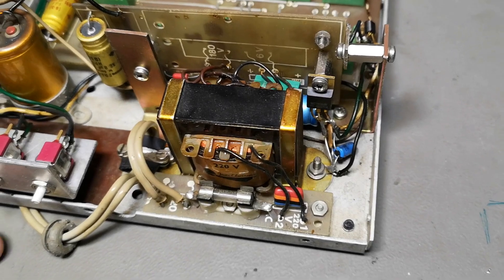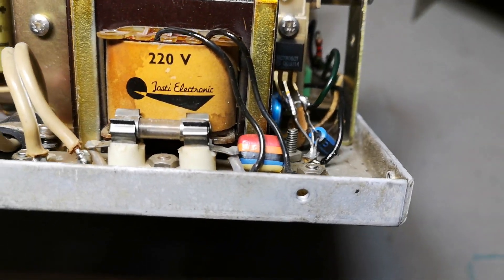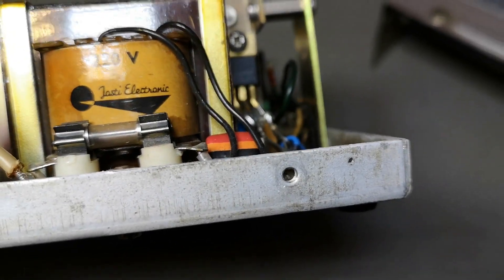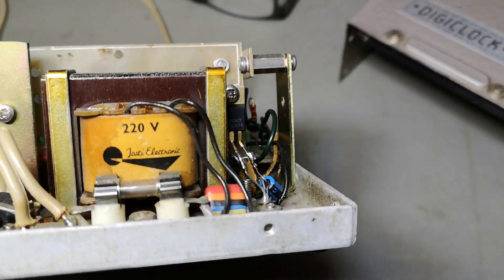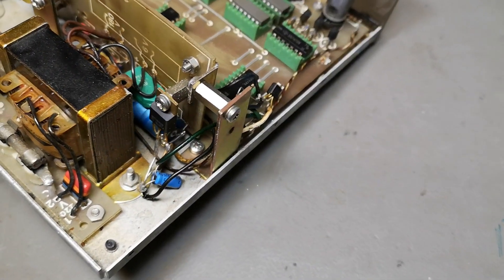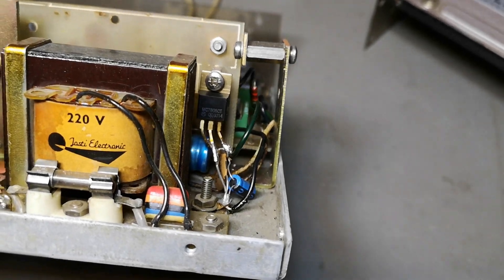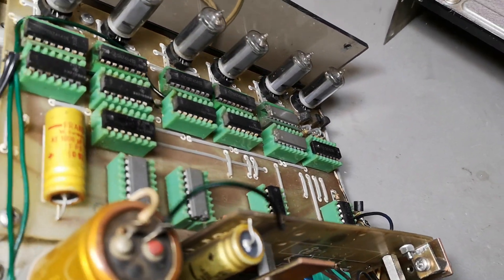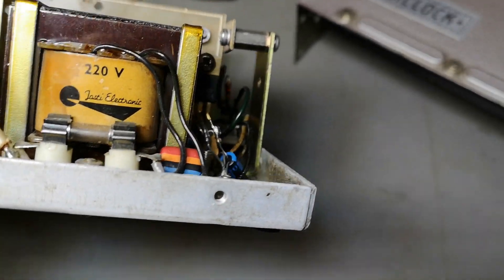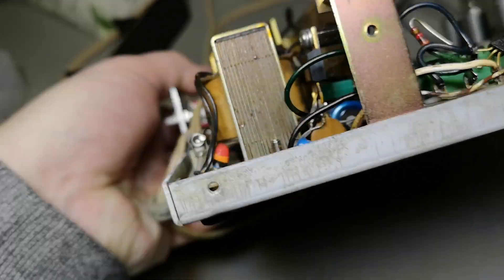Here is the five volt regulator, but look at that — can you see the brown capacitor and the input wire? That capacitor is actually touching the output wire. There is zero safety distance there, so that is a problem waiting to happen. If the input and output are shorted you'll get full voltage out on all your lines — it's probably going to blow up the entire clock. Zero point nothing safety distance around that — really really amazing.